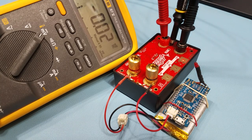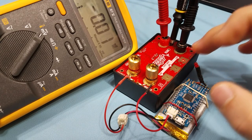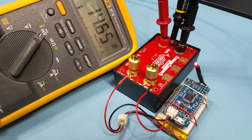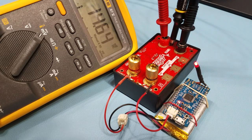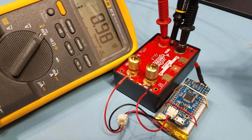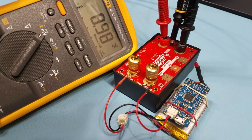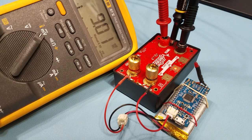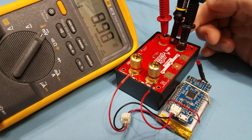To see active auto-ranging, we tap the mA and nA pads and the meter automatically starts ranging. We can now see that when sleeping, it's in the microamp range reading about 9 microamps, and when it wakes up it automatically ranges to milliamps showing 14.5 milliamps. To observe this auto-ranging behavior on an oscilloscope, I have a scope probe attached at the output.